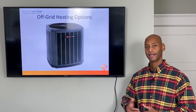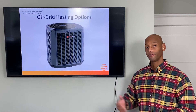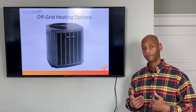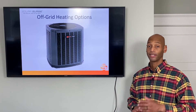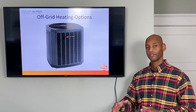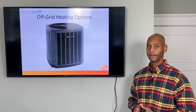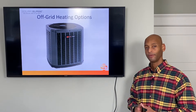This helps you get a lot more running time out of your renewable energy system. The downside is that it's still a finite fuel source. One of the things we recommend to folks using this heating approach — which is actually what we use here at our home — is to have as much fuel reserve on hand as possible. We have a 1,000-gallon propane tank underground. I would recommend if you're going to use gas heat as an alternate heating method, have at least a 500-gallon tank, but if you can swing it, a 1,000-gallon or even two 1,000-gallon tanks in parallel to store more fuel reserve. So if you end up in a prolonged grid-down situation, you'll be able to heat your home ideally through the entire season and maybe even into the next season. It doesn't require any additional maintenance or chores — it's just a matter of storing an adequate amount of fuel on site.